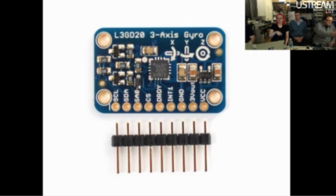We had some space on the breakout where we wanted four mounting holes so you could attach it really solidly, because we'd seen gyros with only one hole. If you're measuring twists, you don't want just one mounting point — you want at least two, and we splurged for four. It does SPI and I2C, and we have example code for Arduino that uses both. I2C is easiest — it only uses two pins. There's a data ready and interrupt pin available; check the datasheet for more details.